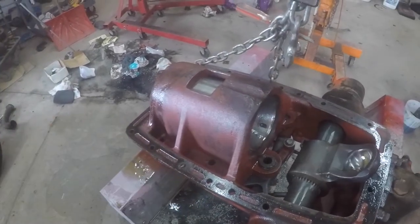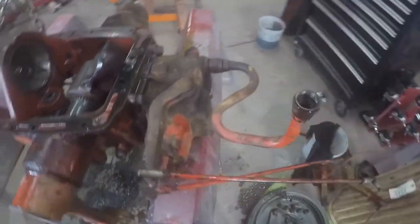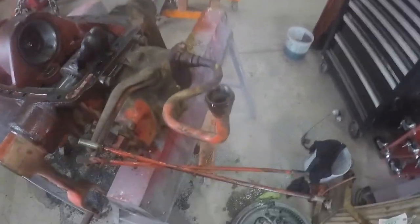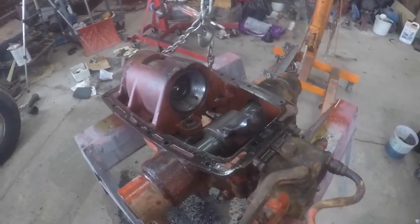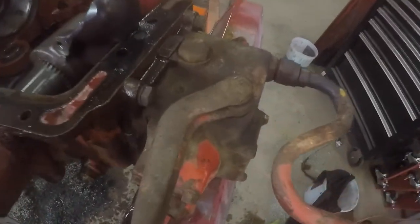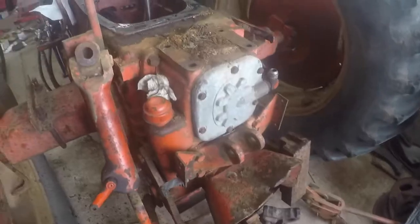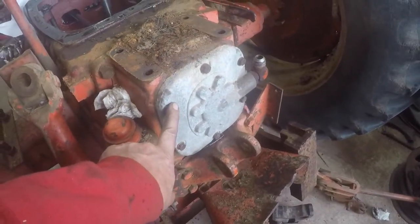Gravity's draining it out — it's just got water in it. I take these hydraulic remote hoses off and they've got water in them too. This thing is just waterlogged. I don't know if it sat for a long time and got water in it, or if it sat in the up position and seized up. That valve is full of water — everything moves on it, which means it's not stuck, but it's full of water. This is the pump, and I would pretty much guarantee it's shot.